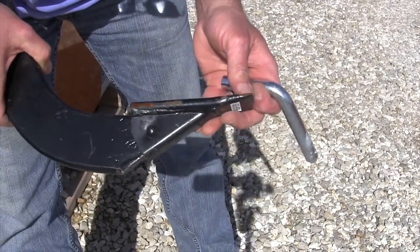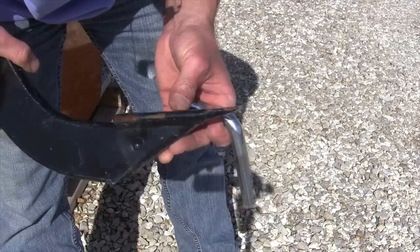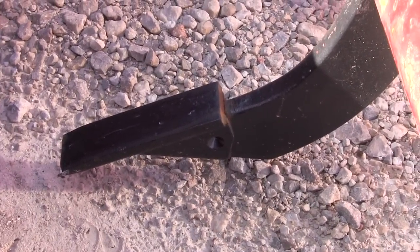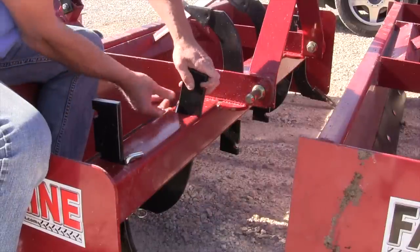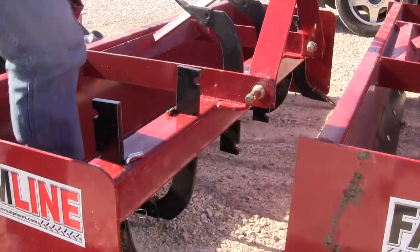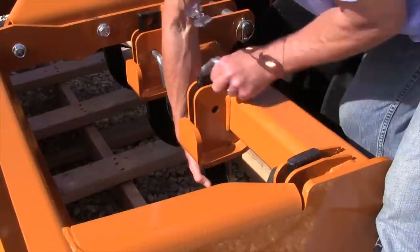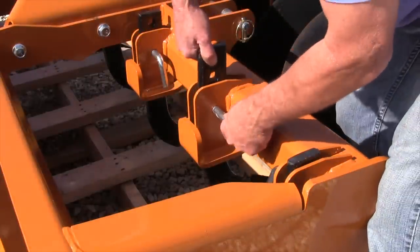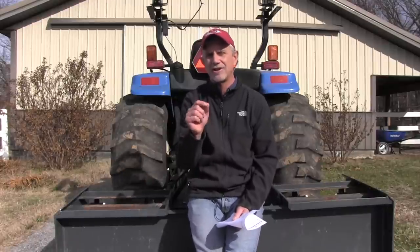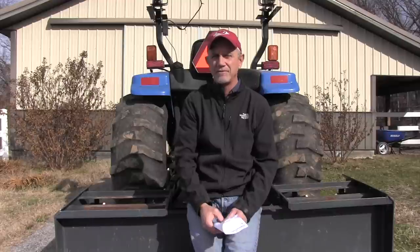The only other thing on box blades is your ripper teeth. Most box blades have ripper teeth that come down so you can lower and dig into the ground. I've never used ripper teeth personally — I live in the Ozarks with rocks right below the surface, so we want to leave them there. But if you're trying to work up virgin ground or packed ground, you may need them. Look at how they mount to the frame: is it a really solid mount so that if you hit something it won't tear the ripper tooth off? Are they heavy ripper teeth that will survive your conditions? And if you get ripper teeth but aren't using them, take them off and store them somewhere safe — as steel prices get high, thieves target ripper teeth because they're easy to walk off with.